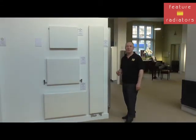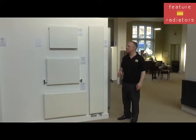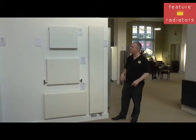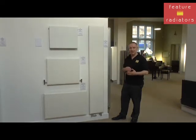In terms of design there are two options. Your first option is a standard steel corrugated radiator with a panel to the front. These types of radiator are normally the least expensive — they're designed to replicate the look of a specifically designed flat panel radiator, but behind the panel you've got a mass-produced steel corrugated radiator. They normally come in different depths because you've either got a single or double panel behind the front panel, and that means you can get an increased heat output from the same height or width simply by increasing the depth.